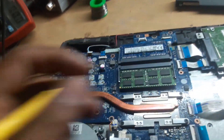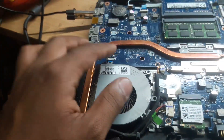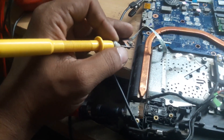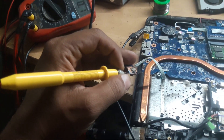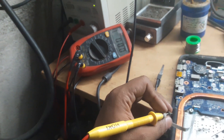This voltage is not available. So first let me remove the power button connector and we will try to power on and check voltages one by one. I have opened the switch. Let me turn on the DC supply — we have the adapter LED glowing. We will check the lid switch; it should be available over here. We check the supply on this pin: it is 3.2V, and on this pin it should be 3.1V — means our lid switch is okay.